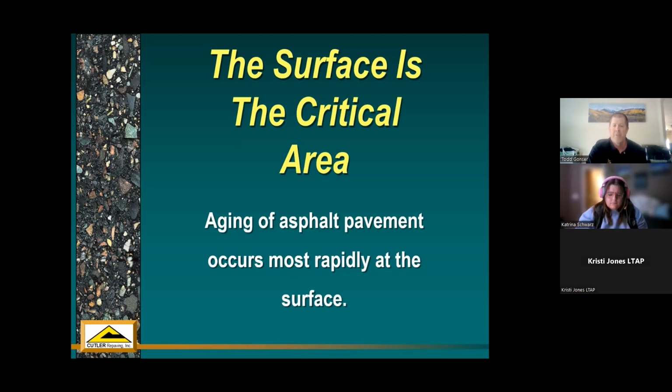You'll notice a new asphalt when it's freshly paved is black as night, really smooth looking. After 2 or 3 years, the binder starts wearing off of that aggregate. You can start seeing the individual rocks, and the surface starts to gray a little bit. That's just because our environmental conditions and traffic and snow plows and all that kind of thing starts eating away at the top of that surface. Once that starts happening, then the structure starts to fail a little bit. And this is typical with every road. It's nothing unexpected, but an asphalt is a flexible pavement and it moves around a little bit, and eventually it's going to crack. All asphalt pavements crack.